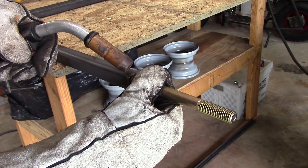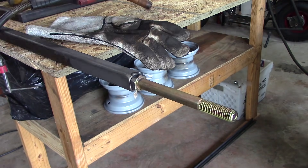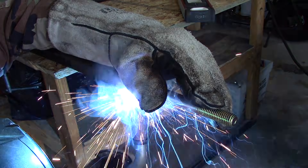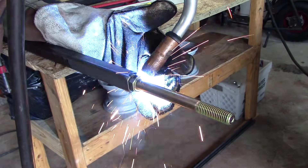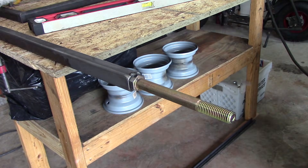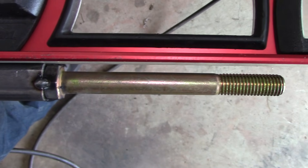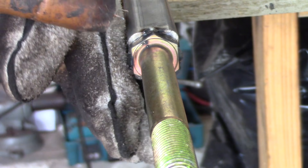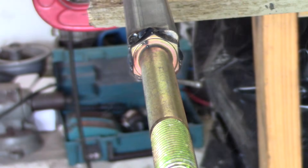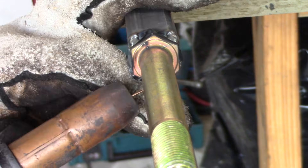You don't just put the bolt on and weld it. You want to put the bolt on right exactly where you want it, then do what's called a tack weld on one side, then tack the opposite side, then the other two sides, so you end up with a total of four tacks. If it's a little crooked after that, just take a straight edge to it and eyeball it. If it's still crooked, beat it with a hammer until it's straight on all four edges. Then do four more tacks.